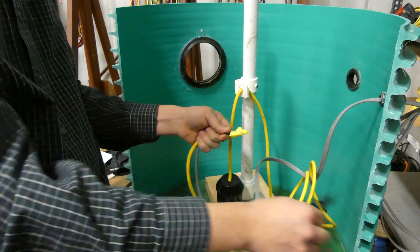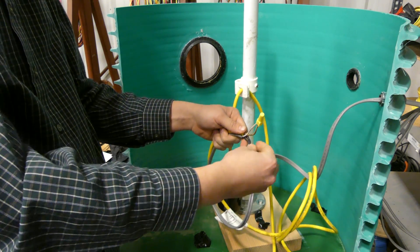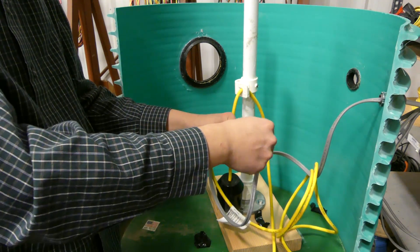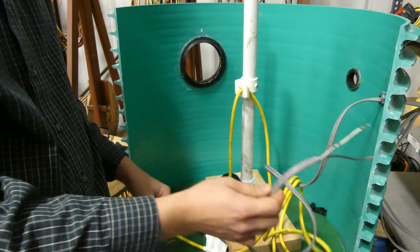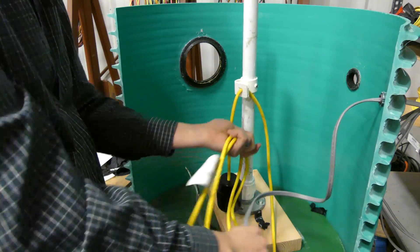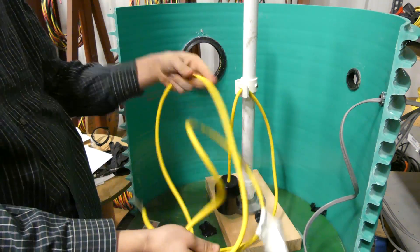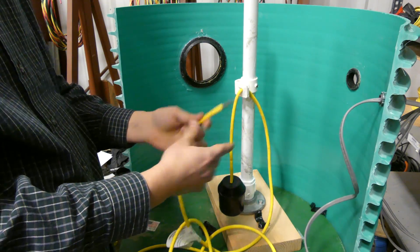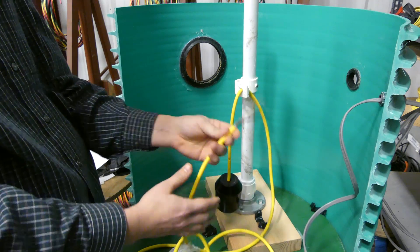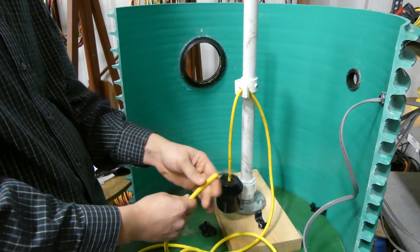The reality is electrical tape will not keep water out very well or for very long. We'll take the wire nuts off, throw those away, get rid of them. Now we've got our UF cable — we'll tuck that out of the way — and the float cable. Since we're simulating, we'll leave the float where it is and show how to perform this splice with the new float.